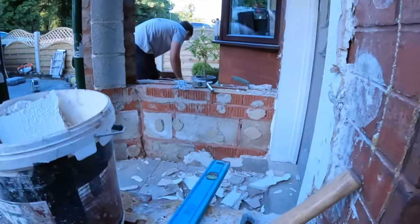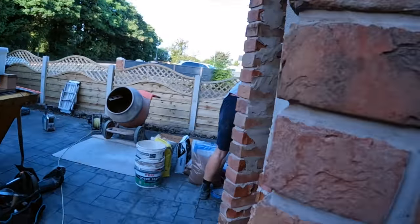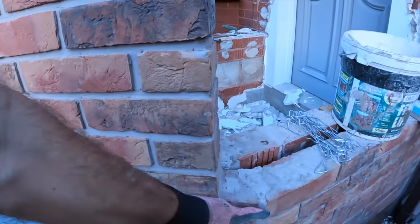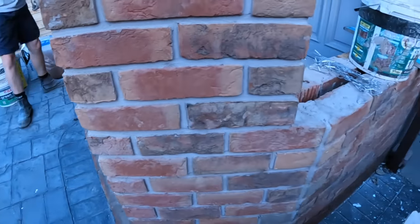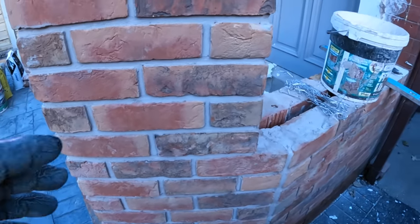Oh yeah, there's an issue on this. Someone's been out to measure up for the windows and doors and said we've done this wrong. Said it should have had squint bricks going around the corner. Now you can't get standard squint bricks because the two angles are different. This was all looked into at the beginning. So they're on about getting cut and glued ones done.